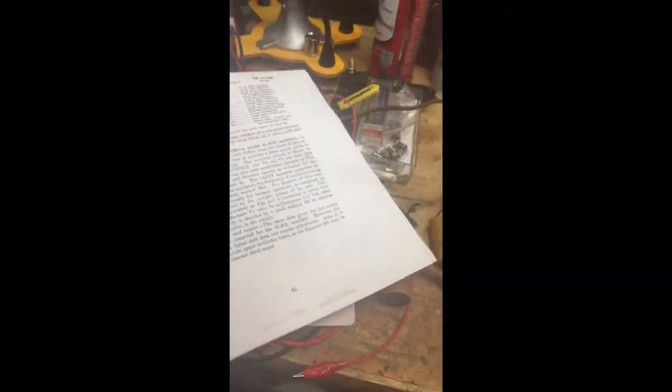And so I've used the schematic that they suggested with the tube complement that they recommended in this document, but I completely ignored the instructions on the side of the unit that we had read a moment ago for 117N7 GT tubes. I don't know, I got sidetracked. I got a little excited about finding a schematic, and these are 4. There are 4 of the same tubes.